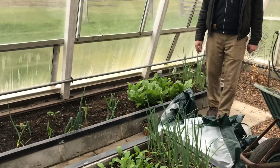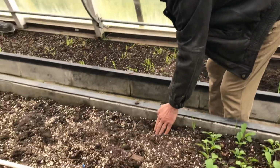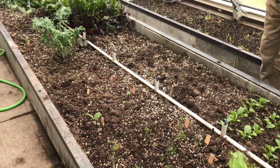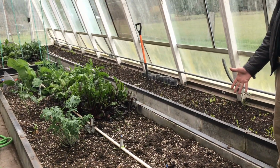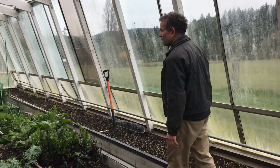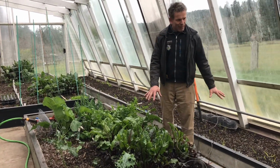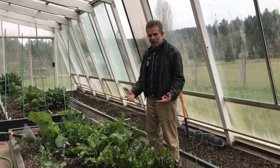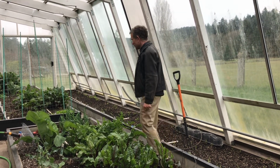And we actually did a little temperature profile. We measured the soil temperatures from here across to the north side, and there's about a 3 degrees temperature difference, we assume from just absorbing all this heat from the sun energy coming in. And the nice part about having this climate battery is when the soil is wet, it's absorbing almost as much thermal energy as water does, so it just radiates heat all the time.